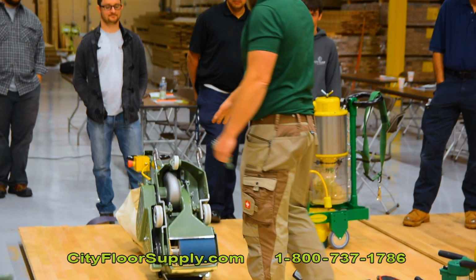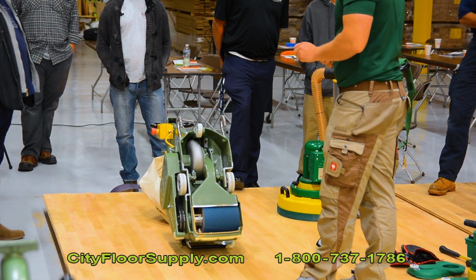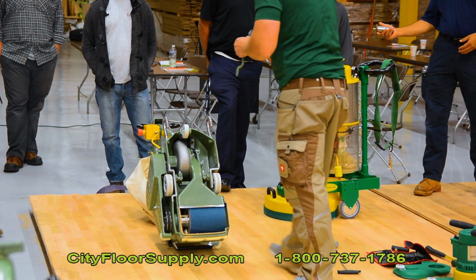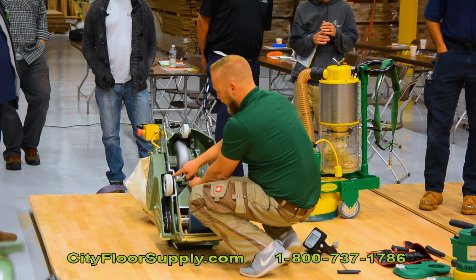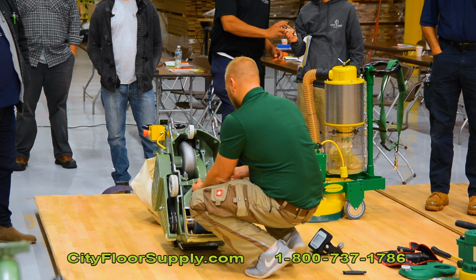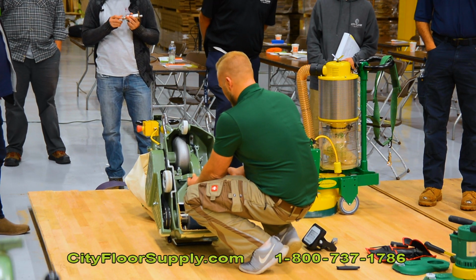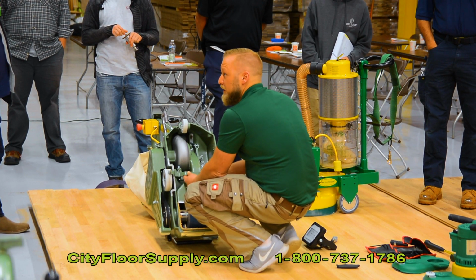Exactly. So if you look at the wheels, one is marked, one is unmarked. The marked wheel can be adjusted. So you take your tool, you put it on there. You see those two edges, they're machine plain, the rest is not. You take the high spot from the wheel that is set in place until it touches. You mount it in place and then you can transfer the height on the other side of the wheel.